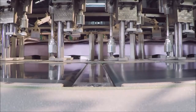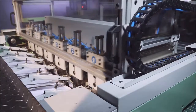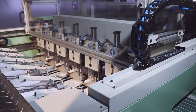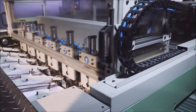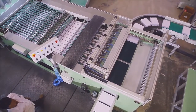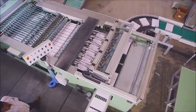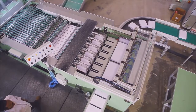The machine has an automatic counting facility to count cut sheets coming into the pockets automatically. The Cut-Size Sheeter is equipped with a heavy-duty robot mechanical unit to collect reams of 500 sheets into the collecting box at every point of completion of 500 sheets in each pocket. The robot unit will automatically come forward, pick up all six reams from each pocket at a time, and place them on a conveyor belt to transfer to the automatic ream wrapping machine.